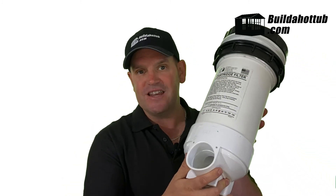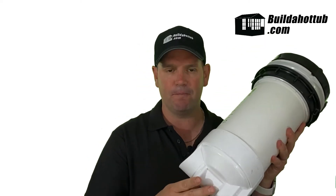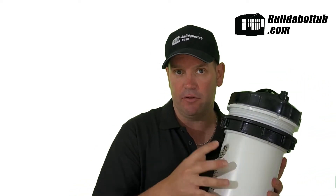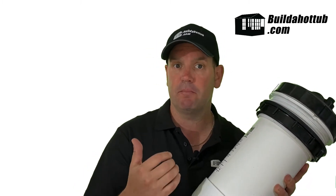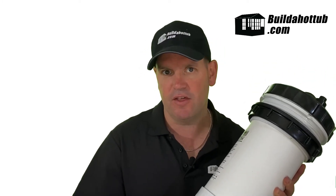This unit, this particular model, has a flow bypass valve. What that means is when the water is on high flow or your jets are running, it's not filtering through the cartridge — and this is to make sure that the flow isn't interrupted on the jets. So it's also really important why you've got to put it in the right way, so that the flow gate can actually open inside of the filter.